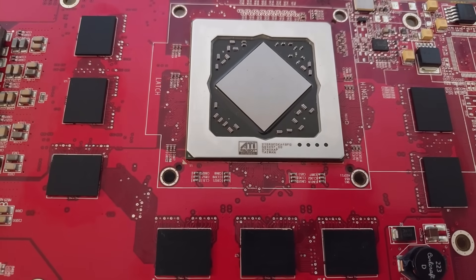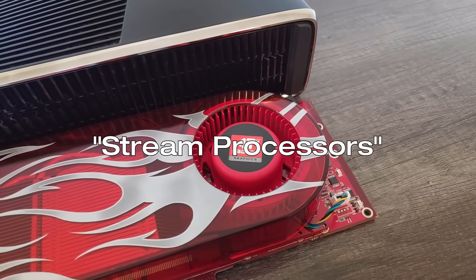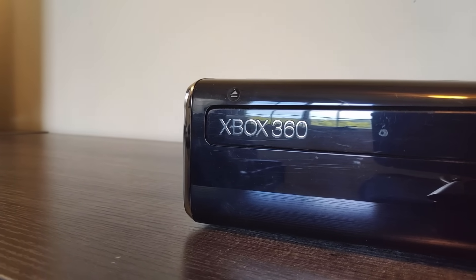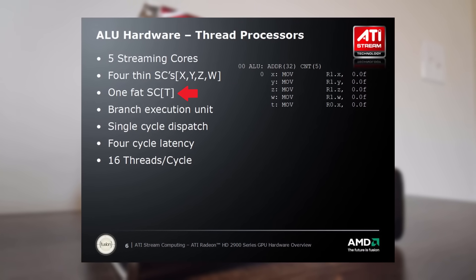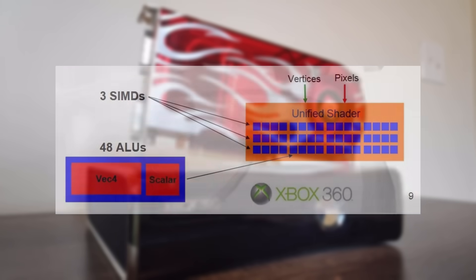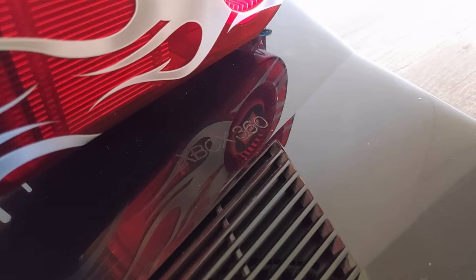The full R600 and 2900 XT has 320 stream processors, but the 2900 GT makes use of a neutered chip with one compute unit disabled, meaning that just like Xenos, we have 48 5-way shader ALUs for a total of 240 stream processors — although that's a bit of a misnomer in the case of Xenos. For R600 GT it's 240 scalar processors, but for Xenos it's 48 VEC4 and 48 scalar processors. R600's ALUs are 5-way in that it has 5 discrete units — the first 4 referred to as thin cores and the 5th being a more complex fat one for special functions — while Xenos's ALUs are 5-way in that they can co-issue VEC4 and scalar instructions simultaneously. Being a very long instruction word architecture, R600 runs 5 entirely independent instructions in parallel and is made to take advantage of instruction-level parallelism, while Xenos does not. In short, both GPUs have a similar amount of functional units capable of similar things, but they process data pretty differently.